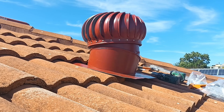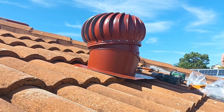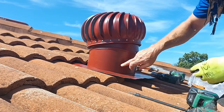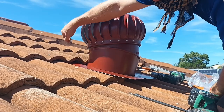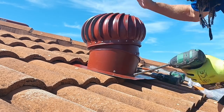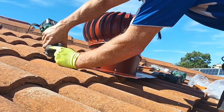I am going to grab four screws, which haven't come with it. Normally when you buy one of these they'll supply the screws, but on this particular make it hasn't. I like to put the screws in diagonally — diagonal, diagonal, diagonal, diagonal. Main reason is all the water will be hitting down there, and once it comes past there it's not going to affect the screws. So we go diagonal.